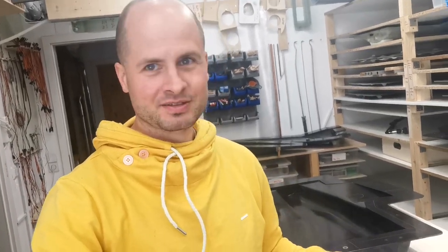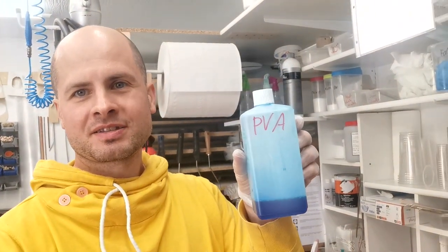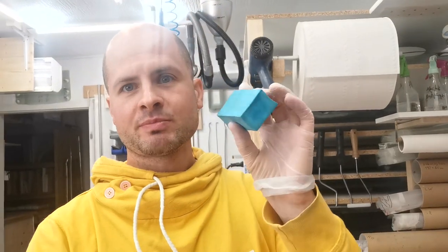Now about four hours have passed, the wax is hardened, polished, and everything looks nice and shiny. The next step is to apply the second release agent — the PVA. This is the blue liquid agent; PVA stands for polyvinyl alcohol and it is a very powerful release agent. The important thing in this step is to apply it in a constant thin film, and for that we use this special sponge, which I will fill with PVA to show you how to apply it all over the mold surface.